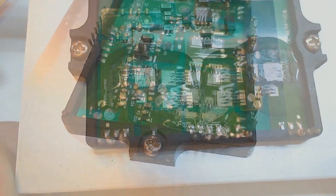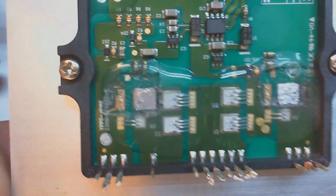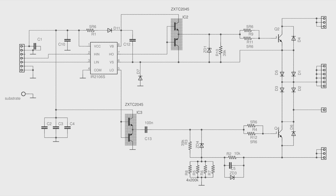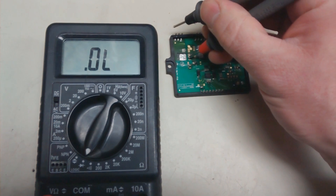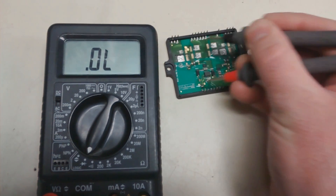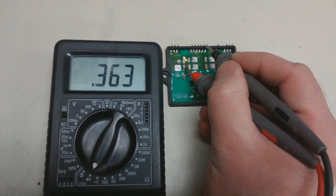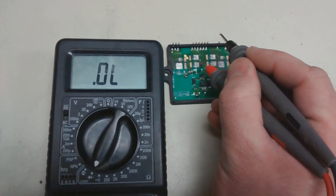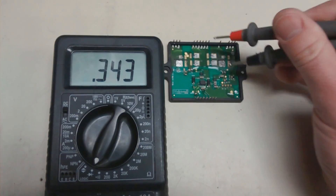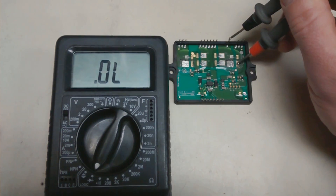Once the transistor has been completely removed, the board looks like this. This is the schematic. You could now test the gate driver and buffer transistors and diodes, but I will only do the power diode since I'm pretty sure the rest is ok. Testing the gate driver is a little more work and not necessary here. Testing the power diodes shows they are all ok.